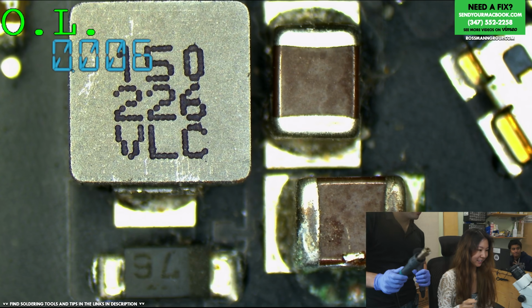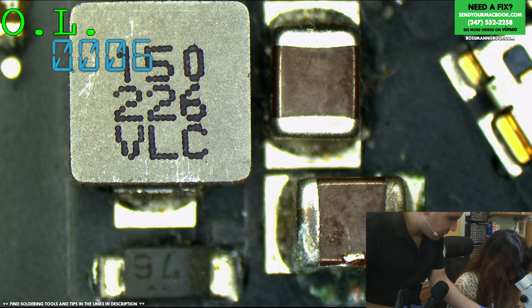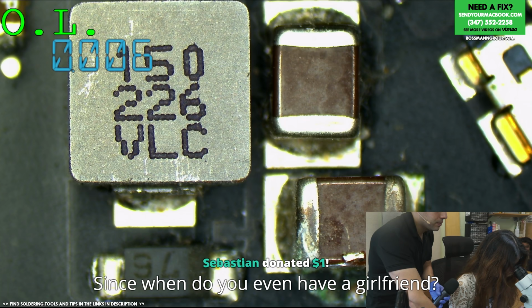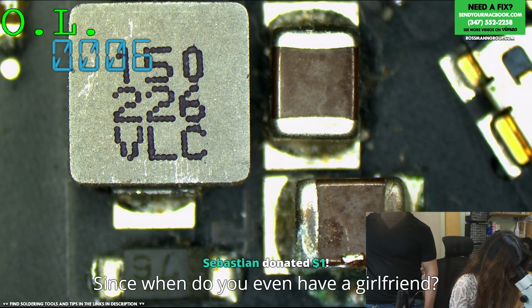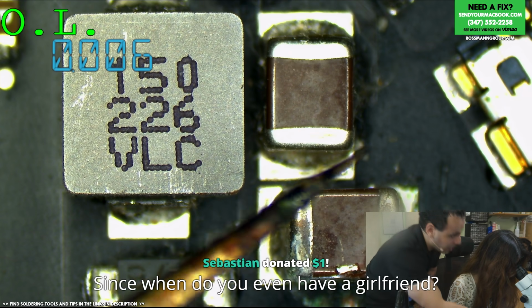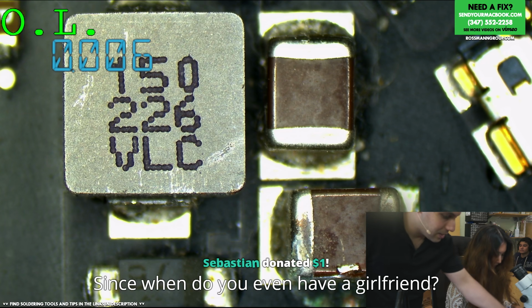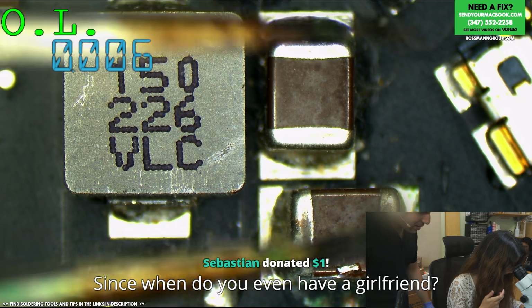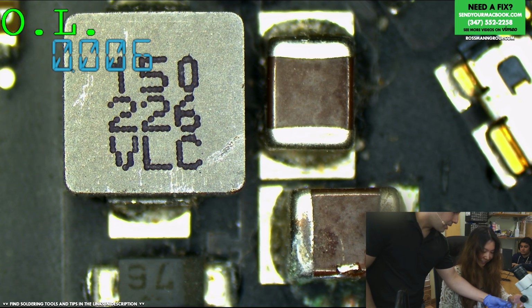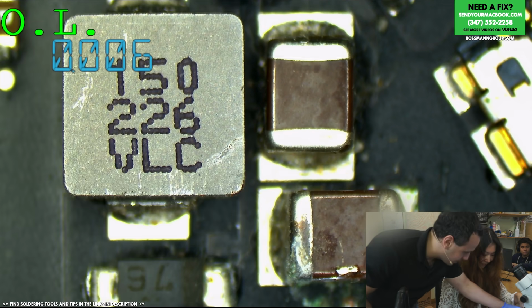First thing I want you to do is look in the microscope. Okay, I see it. Can you see well? Yeah, I can. Very good. Now, you're going to hold that. Here. Now, with your left hand, grab the tweezer. My left hand or my right hand? Left hand, grab tweezer. And now, left hand, use the tweezer to grab and hold that capacitor. But now try to hold it from the red part. So you're going to have to angle it, instead of it being like this. And try holding it like this. See how you're holding the tweezer like this? Try holding it like that. No, not like that. See, the tweezers are going up and out rather than into my hand. Do that. Like so. All right, now your turn.